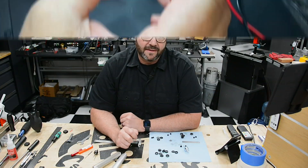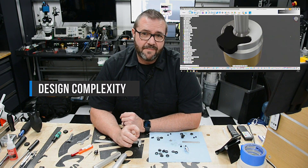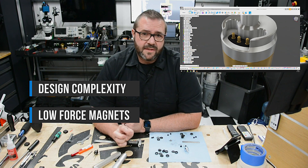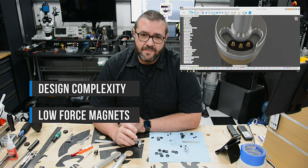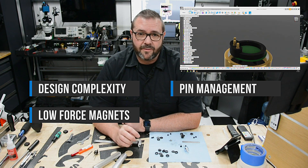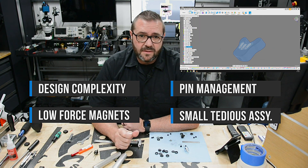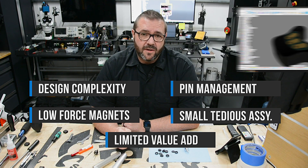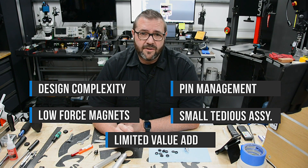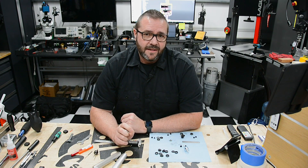The problem I had was with the performance and design complexity. One: it imposed a lot of complexity on the top part of the probe body to encase the magnets and align the connector, requiring several milling operations. Two: although rare earth magnets were used, the strength wasn't as good as I had hoped and space was very limited. Three: the pogo pins were tricky - in an all-metal enclosure they had to be isolated to prevent accidental grounding. Four: the assembly was small and tedious to build. Five: all in all, the magnetic connector really didn't add any value and the usability was marginal.